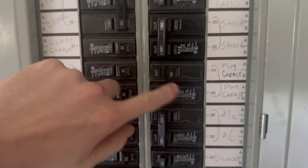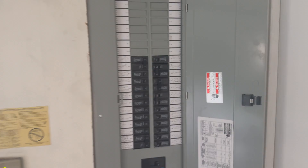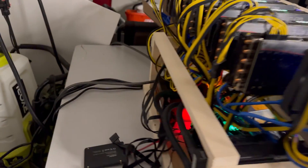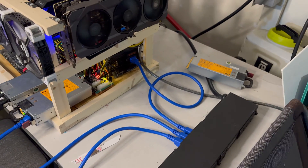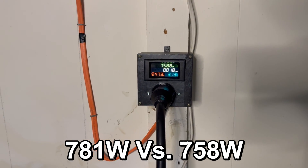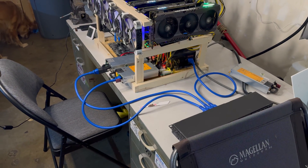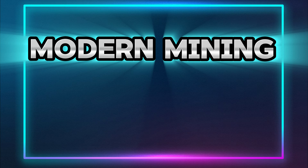There's the finished panel — it looks awesome. Wires running straight in with plenty of room for extra breakers if I decide to expand. Right here you can see my 30 amp circuit I ran in. I wanted to do a quick test before switching over to 240 volts — we were at 781 watts, and switching over to 240 volts with the PDU plugged in, we're down to 758 watts, about a 3% decrease in power. Across my entire farm that's pretty good, but not as much as I was hoping. Stay tuned — it's getting hot outside so in the next couple weeks I'll be moving the rest of my rigs down here.